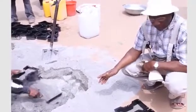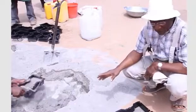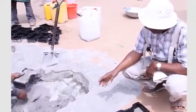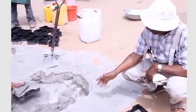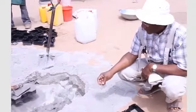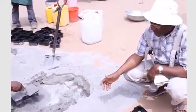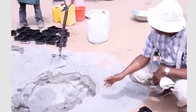And after they have been removed from the mold, then it will be necessary to sprinkle water on the hardened concrete stones so that they'll get harder and harder as the days go on. So it is an easy work, like everybody can see.